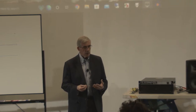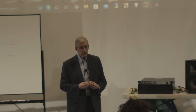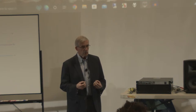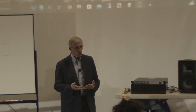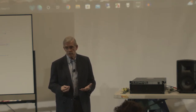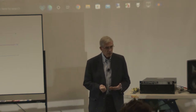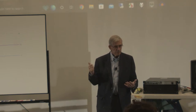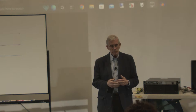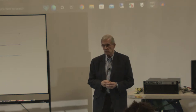In fact, they're rated in what we call decibels, and we're going to do another class and talk about decibels. But speech is usually between 15 and 20 dB of headroom that you need for speech. So that means that you don't have that much headroom above RMS to peak, so you've got to run a lower RMS if you're not going to clip the peaks in speech.